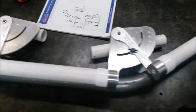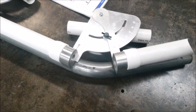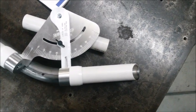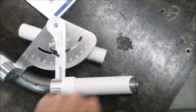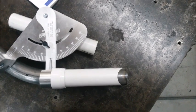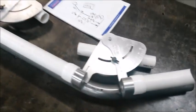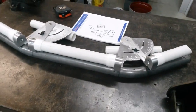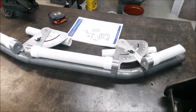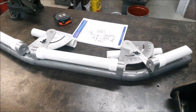Let's check out our 36-degree bend. Looks pretty good. Our tangents line up really nice. You see, this section was 8 inches, and I left a little bit extra on that end as well. And sure enough, we got about an extra 1/2 inch or so. So as you can see, the math really does work. The cage gauge is extremely easy to use, but you get excellent results. So let's notch this thing and we'll see how it fits.